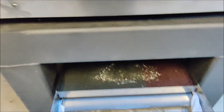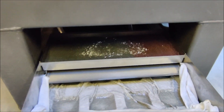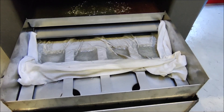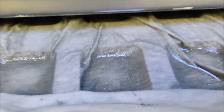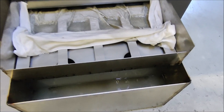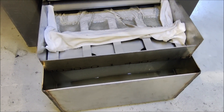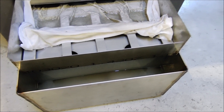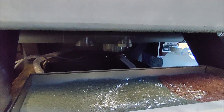The coolant tank has another filter tray. The first one will catch the big chips that manage to escape from the enclosure, and from there it will fall on what for now is just a piece of fabric, but I need to find some kind of paper filter to filter all those super tiny chips out. From there the water falls into the coolant tank, which has a first compartment I hope can act as an oil trap, because after the water falls it needs to dive underneath it. All the way in the back there is a coolant pump which pumps the water back up.